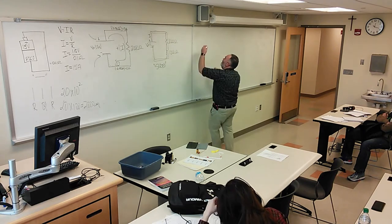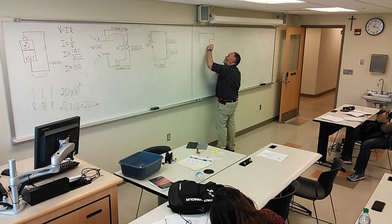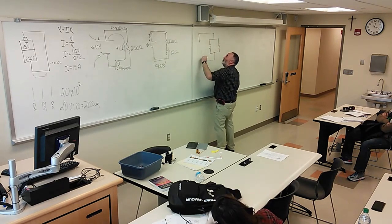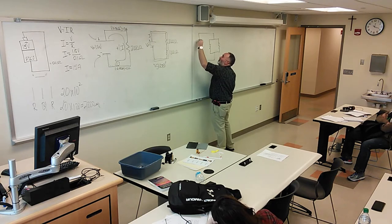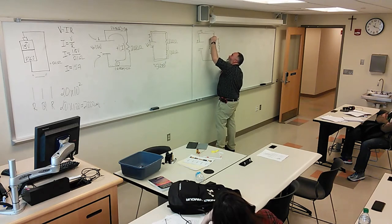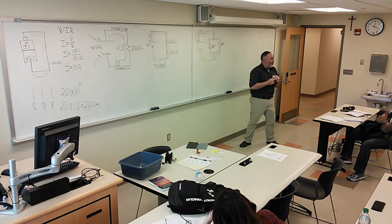So we could do it this way. We could take this wire and do this, and then this wire, and go this. Here's our Y again, positive, negative. Here comes the current again. This time around, the current splits. Some current goes this way, some current goes that way, and then it meets up at the bottom again. This is still our 2,000 ohm resistor, and this is our new 1,000 ohm resistor. Okay?